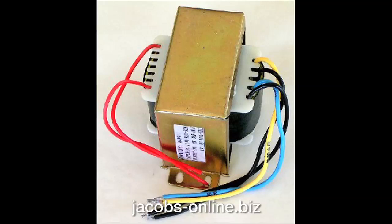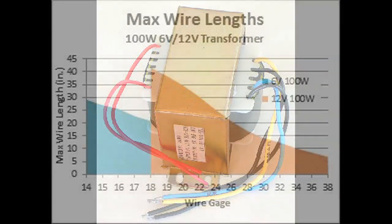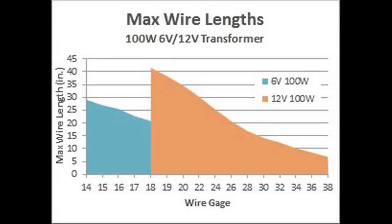There are a wide variety of power supplies available through their website, which may be more ideal for your specific project. But the XFR1006D allows for a wide range of nichrome wire gauges and temperatures, all of which are highlighted within this diagram. You can check either Jacobs Online or HWFCI.com for more information regarding nichrome wire and its electrical properties.